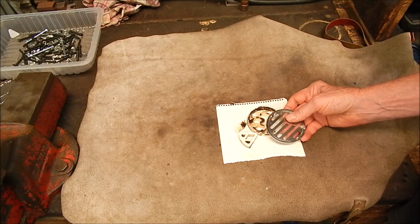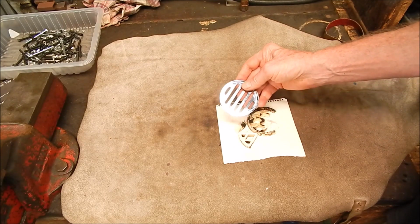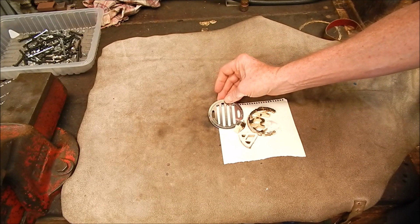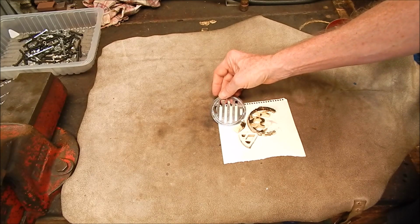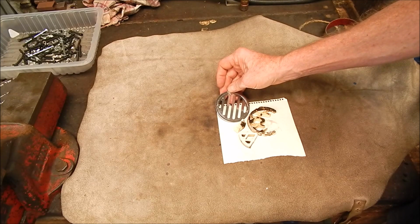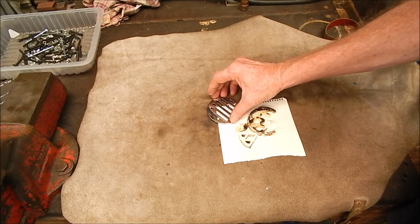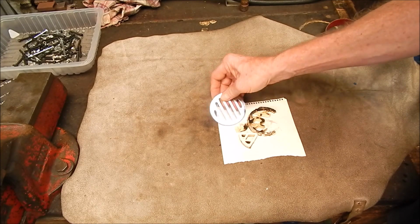And of course in the smaller sizes you can buy just this, but in the larger size like this you've got to buy this and the base, so double whammy on that. But anyway, the problem is that then you find that it's the inside diameter, like where the little dogs engage, should be okay, but the outside diameter, because this is a flush fitting thing, it's about 2 or 3 mil too big, and it won't drop into the cavity, into the recess.